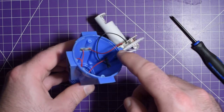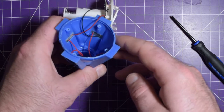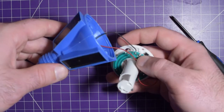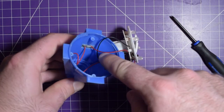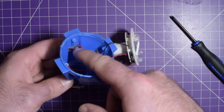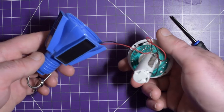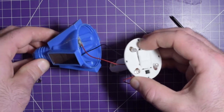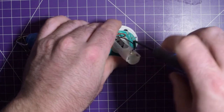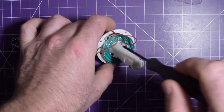Okay. So I'm seeing all these solar panels here are in series. If you look, there's only two wires going to the unit here. So one and two. And if you follow the red here, the red goes in one panel, out the other, then into the next one, out, into the next one, out, and then out this black wire here. Very interesting. Let's see if I can lift the circuit board off of here and take a look. I'm not sure if it'll be as in depth of a look as Big Clive, for example, would do, but let's take a look either way.